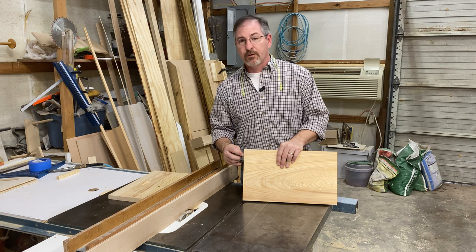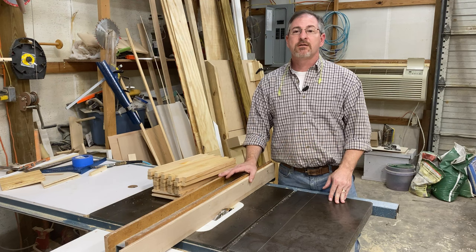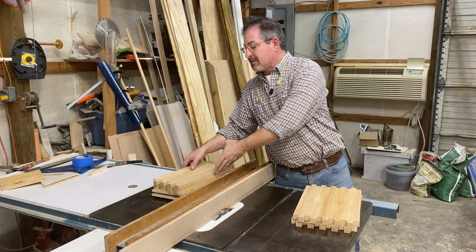For the box we're putting together with rabbet joint construction, we'll run a 3/4 inch wide, 3/8 inch deep rabbet along the end grain of the front and back pieces. I've adjusted our fence over from 3/4 to 5/8, and we'll use that setup to get our frame rest in the tops of our fronts and backs for our 7/8 box joint construction deep, our 7/8 box joint construction medium, and our rabbet joint construction.